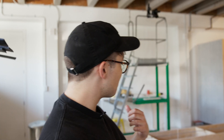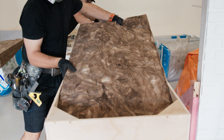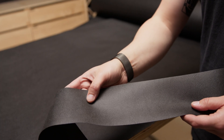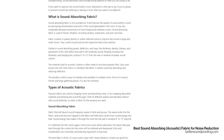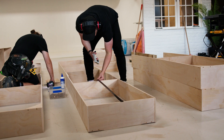So it's day two and it's time to turn these boxes into sound panels. We're going to put some acoustic-appropriate fabric on the open faces, fill them with rockwool, and then put a frame around the outside to tidy it all up. We picked up ours from an industrial fabric supplier that specialises in this kind of material. A fabric needs to have two qualities: it needs to be open enough that sound can pass through, and it also needs to hold all the fibres of the rockwool in. If the material is too dense, you get a lot of the sound bouncing back off, so selection here is important. We're also adding a strip in the middle to support the weight and prevent sagging.